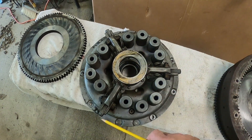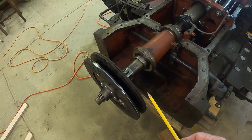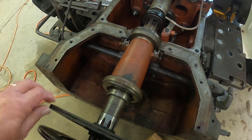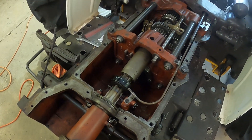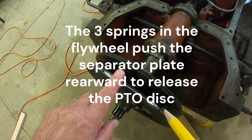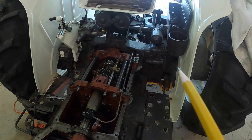When you apply the clutch pedal it moves the carrier forward. You have a release bearing here. This applies pressure to the front of the plate — this release pad. There are three release levers that, when the clutch is applied, start to push this down or into the cover. That releases pressure on the first disc — we're talking about 60 thousandths of movement on this disc, allowing the disc to move backwards and release the pressure. So now the gearbox will stop spinning. At the same time you're applying the pedal, the band brake is clamping down onto the stop drum to stop the gearbox from turning, thus allowing you to put it in gear.